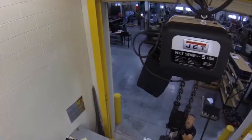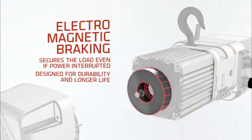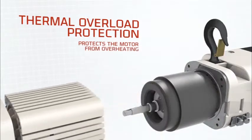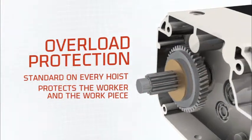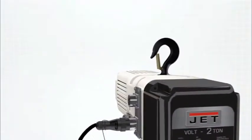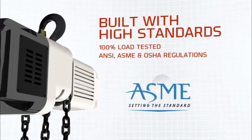I really mean it that every guy in here wants that control, wants that Volt hoist, and that would be our goal to replace any one, two, or three speed hoist with a variable speed Volt. In addition to these great features, the Volt series electric hoists are packed with other JET innovations that lead to a safer, more productive lifting experience. Electromagnetic braking is an industry proven safety feature that secures the load even if power is interrupted to the hoist. Thermal overload protection protects the hoist from overheating and protects your investment. The Volt makes safety a priority with overload protection, which prevents the operator from being able to lift more than the rated capacity of the hoist. The Volt carries an H4 duty rating and is engineered for the most demanding applications.